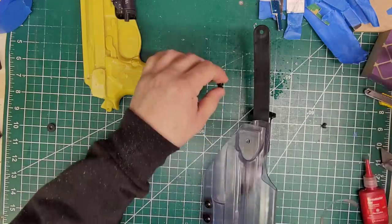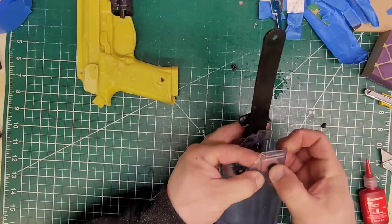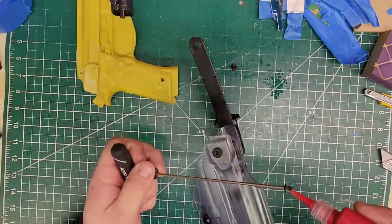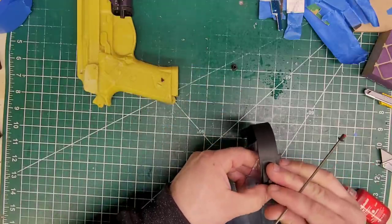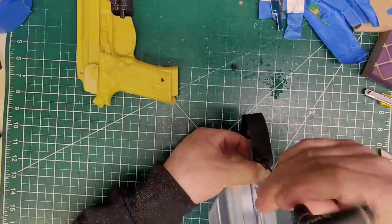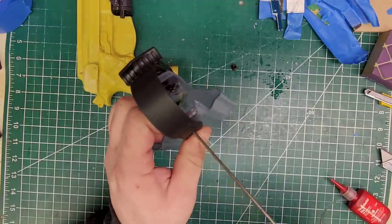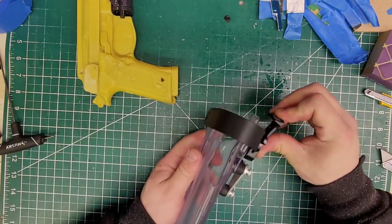You don't want this one. You want the other one it comes with. There we go. That's a quarter inch. Then you take the eighth inch washer, grab the hex bit, Loctite the hex bit, throw that on there, and what that will do is it'll tighten against the slotted post, which allows this to have free play. And bam.